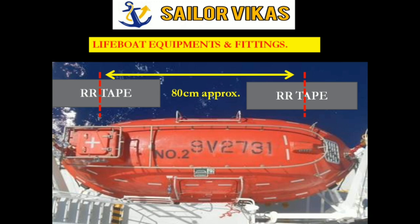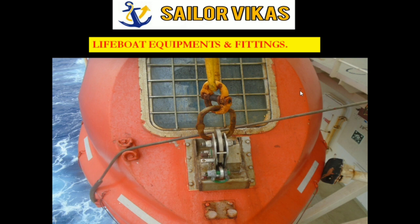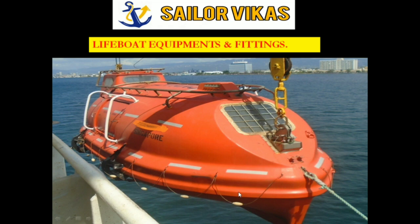Now the other thing is the lifeboat hull. This also comes under monthly inspection, and this is the most important inspection. Here we will check all the hull area. There should be no cracks or dents in any part of the lifeboat hull. We will do a thorough inspection of the lifeboat from the top and from the bottom area.